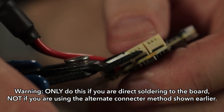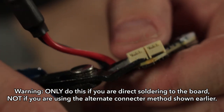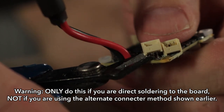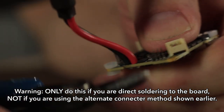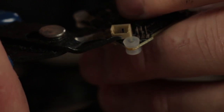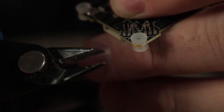Repeat the same process for the other three holes. Be careful not to rip the gummies — they give you an extra one just in case. The easiest way I've found to direct solder is to cut these plastic connectors off. If you're careful with a set of cutters and get underneath the plastic, wiggling back and forth as you squeeze, you can get the plastic connector to come right off. Do that three more times to get all of the plastic connectors off without taking off any of the circuits.